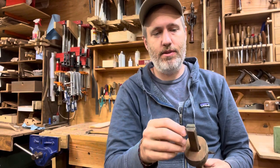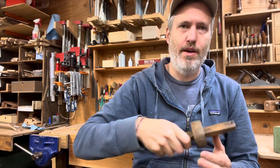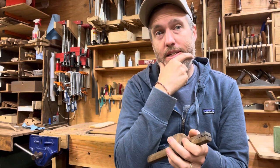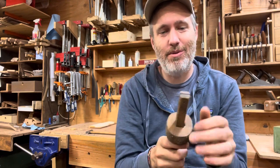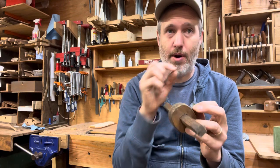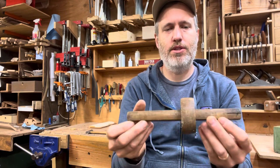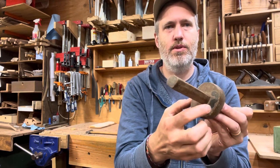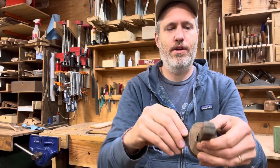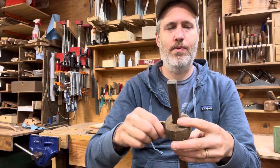He sent three marking gauges. These marking gauges are — instead of scribing a line with a pencil — you would scratch it with this pin or sharp knife blade. A sharp scratched line is finer than a pencil line would make. A lot of old woodworking is done this way, and a lot of the old things I examined still have the marks from these left behind as ghosts. This one is boxwood, pretty simple. It's got a little rosewood cheek there for riding against your wood.